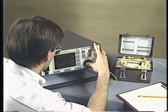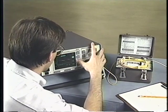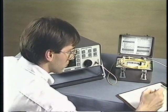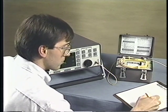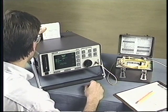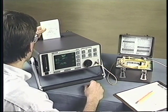One note about testing your splices. For a lengthy span of fiber containing many joints, an OTDR is a convenient tool used to measure splice loss. Splices in single-mode fibers must be bidirectionally measured and averaged to account for exaggerated losses or gainers displayed in one-way OTDR readings. High losses should be retested at 1550 to confirm the influence of a bend.